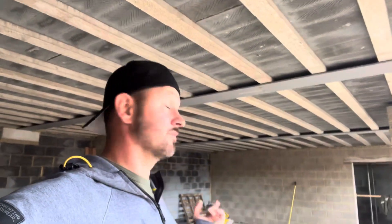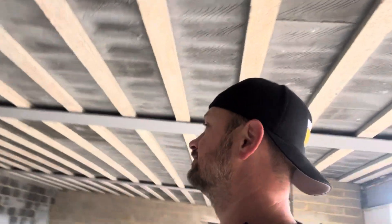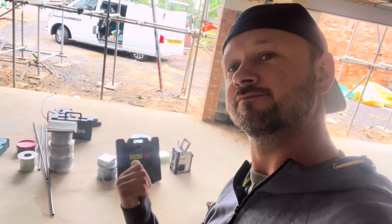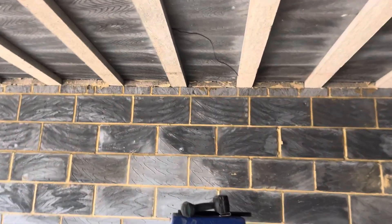Today we're going to make a start on this downstairs garage. The ceiling will be coming down so we've got a void where we can run all our cables, and the walls are getting dot and dabbed so we can clip our cables direct to that. We've got a plan of what we're going to do - I've got to choose my cable routes and get it wired. I've got my kit out and I've got to get a whole run along here, then break off to the areas where the electrics are going.